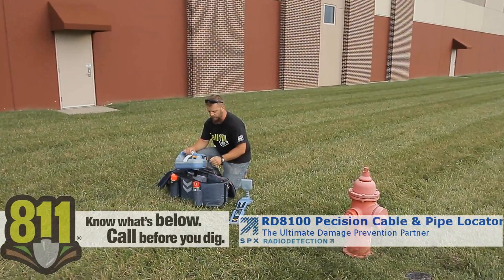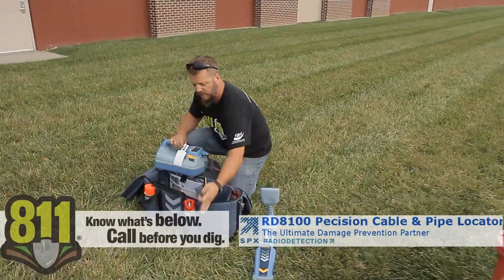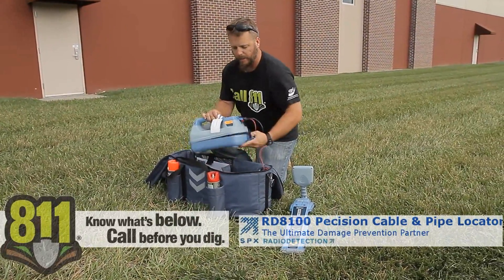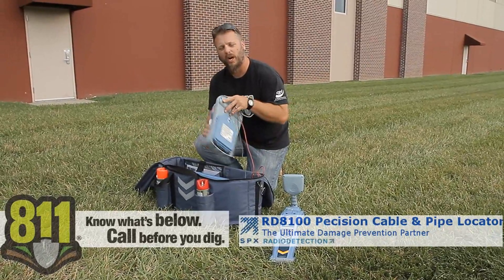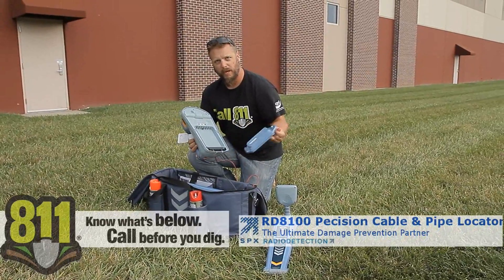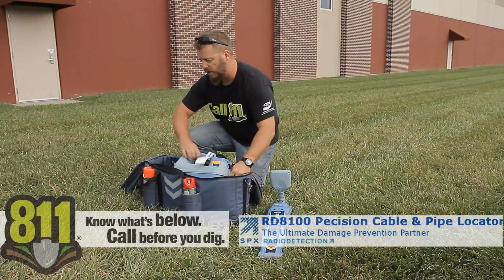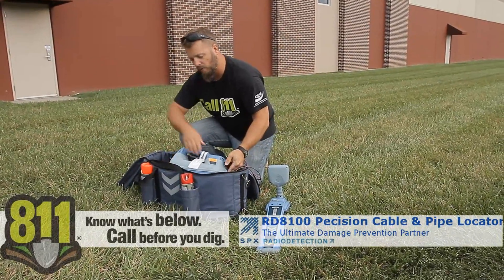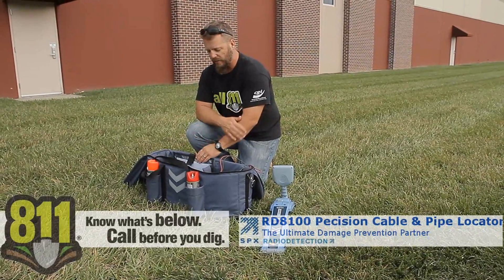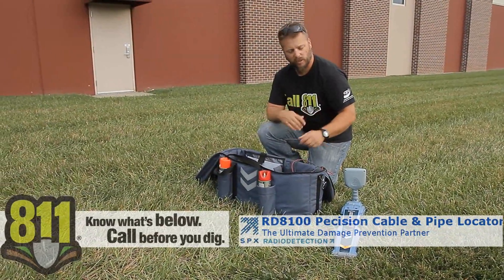They still give you the same convenient bag with nice storage areas for your paint, ground rod, and other utilities. The transmitter still comes in a 5-watt or 10-watt selection, and you can get a rechargeable lithium-ion battery pack to go inside the transmitter. This 10-watt transmitter comes with over 30 frequencies and current direction frequencies, which tells you which way the current is running on the line when you apply it.